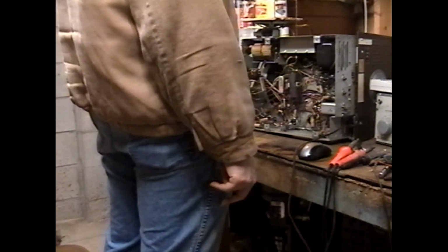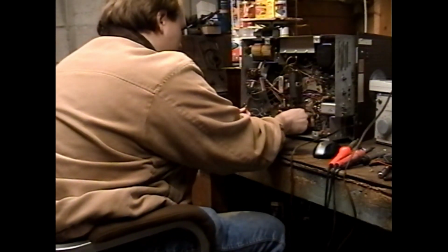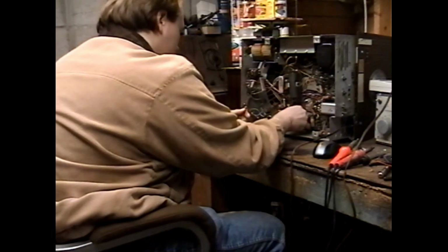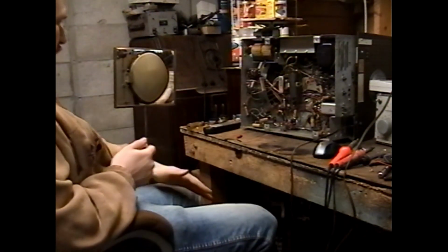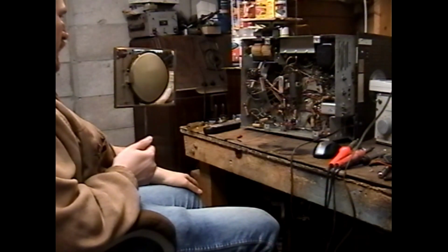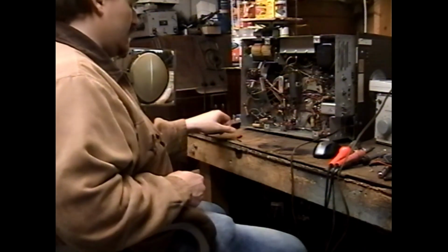Fix your tubes there. I like it how they don't tell me what the heater connections are on the SAM schematic. I'll just have to infer that visually. That's fine. I'm pretty sure this black wire here is the heater, because it goes from tube to tube to tube to tube without any components getting in the way. So we're just gonna... Okay, we have enough of a line for me to see and for you to see.